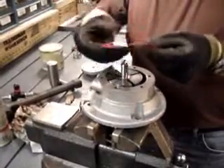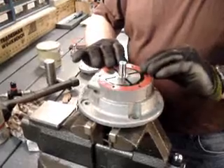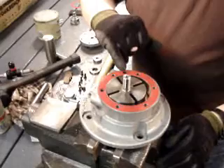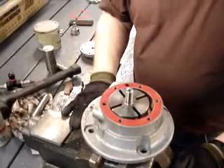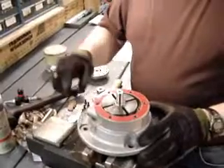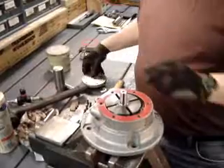Now we're going to take our gasket. There are a set of holes on here — some that are there to reattach the dead end plate where we're going to screw the top back on. And then there's a really important one right here: there's an air intake hole here. If we cover that with a gasket obviously it's not going to work properly — you're not going to be able to work your motor, it's not going to turn because the air is being blocked. So we want to make sure that it's always put on in such a way that it never gets covered. There is a spot where the split pin from your dead end plate, when we tap that back in, will make its own hole, so you don't have to be concerned about that at this point.